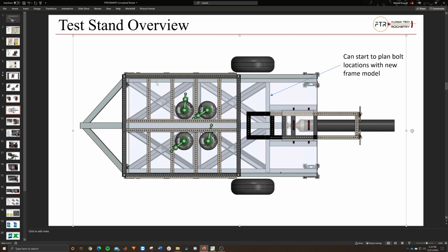And then the frame itself, we can actually bolt. So this is the I-beam on the sides. We can bolt directly onto the outside of the I-beam. You can drill through that I-beam and put like a 1/2 inch or a 3/8 inch bolt through, bolt it into place, and it should be strong enough. We'll have to determine the amount we put on the sides here and here, and then we'll just bolt where we can on extra supports down in the middle.